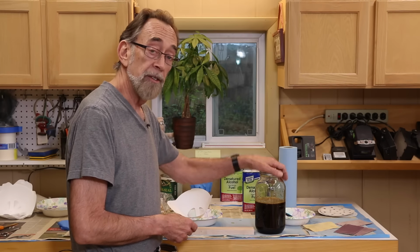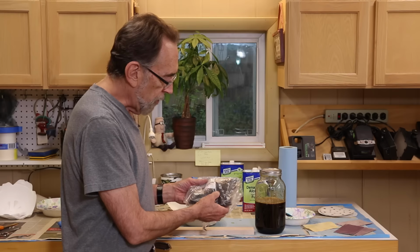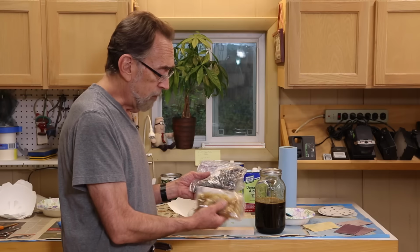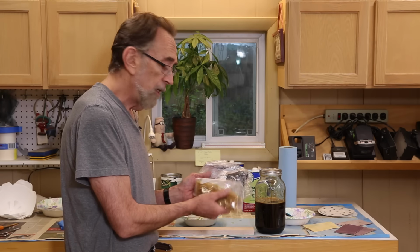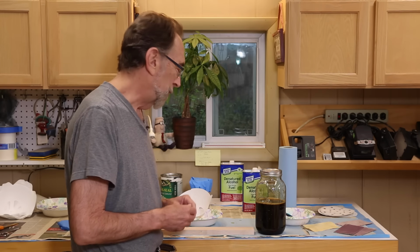Now, this is a pretty heavy cut. This is a 3-pound cut of shellac, and it's made up of these blonde shellac flakes and these garnet shellac flakes. These are really nice shellac flakes, by the way. I got these from Highland Woodworking, and the quality is really nice. By the way, the difference between a blonde or super blonde and a garnet, or the darkest and lightest color, is just the amount of refining that's been done to the flakes. As a result, these darker flakes will have some impurities that will settle out in your shellac, and you'll be able to see that. You won't be able to see it on the camera, but you'll be able to see that when you mix it up. Don't worry about that, because it's always going to go right straight to the bottom, and if you use just a little bit of care, you won't get it on your project.